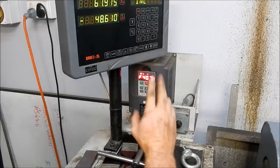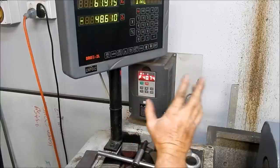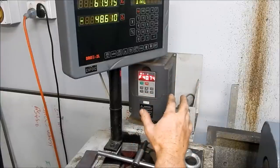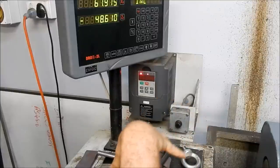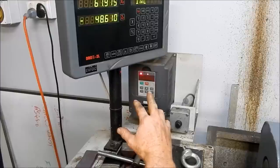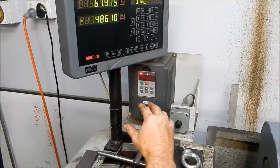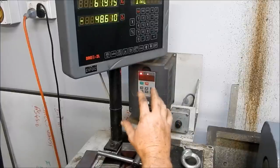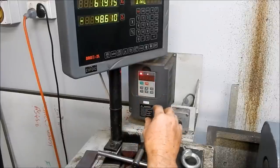One of the things I need to do is adjust this VFD. Now, with this large amount of mass that I've got to get up and going, it does put a huge strain, particularly on the headstock gear sets. So I need to set an acceleration rate for this faceplate, or this gear, to ramp up to. And when you start getting some heavier gear bolted onto the big chucks or the faceplate, that inertia that you've got to overcome obviously increases dramatically.